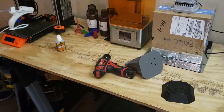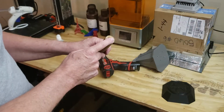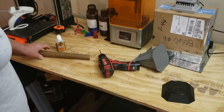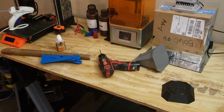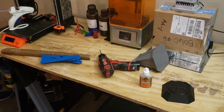So that's 3 things we're considering when we're 3D printing: how much infill am I using, and what kind of plastic I'm using, filament. Make sure it's not too heavy and they can withstand the strain. If it's going to be a high use piece, consider printing on an angle. Your printer can handle from 0 to about 40 degrees without any kind of support. So use that, take that advantage. And 3, sometimes we want to use expanding foam in order to make sure the piece is a little bit more secure than it would be otherwise.